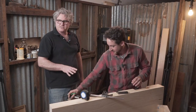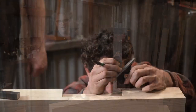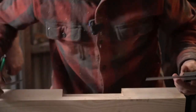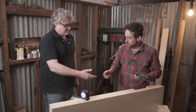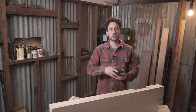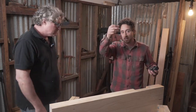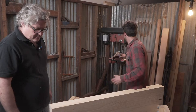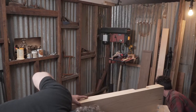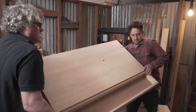All of those holes are marked out, which means now we can lift this up and put it onto the actual legs. I'm going to drill four holes with a forstner bit first, which will accept the cup head of the bolt, and then follow that with a drill bit. During the week I've glued our tool tray onto the main body of the top, so it's starting to look like a real bench.